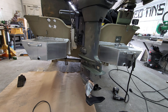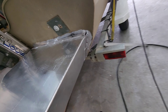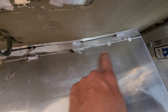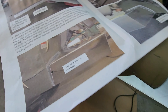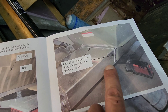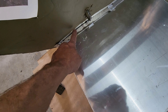We got both pods tacked on and I had to add a strip of metal in the back. On the side I'm also going to have to add a piece up inside here — there's no room to even get in there to weld it. I had to grind this top strip so it kind of fits, but the transom is still wanting to suck away from me. That's actually what the instructions tell you to do — you can see here it says 'gap between pod and transom,' and obviously we had a pretty good gap on the side, so I added this piece in. Now instead of one seam, you've got a seam on the pod and a seam on the transom — twice as much welding.